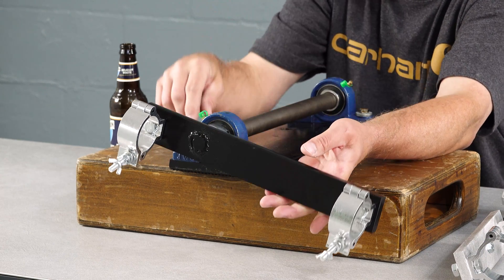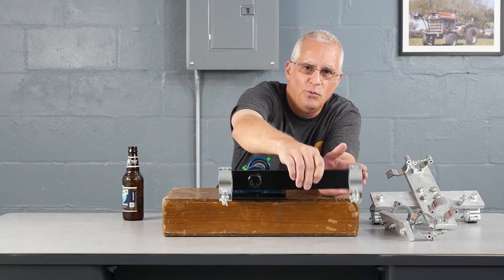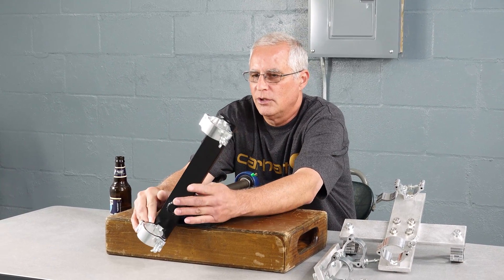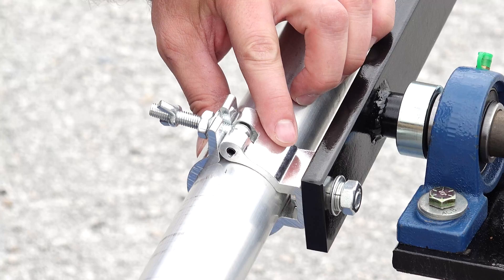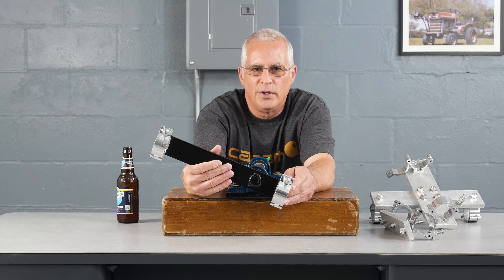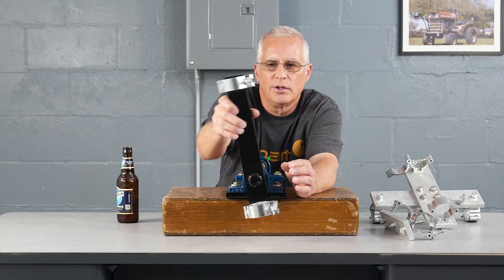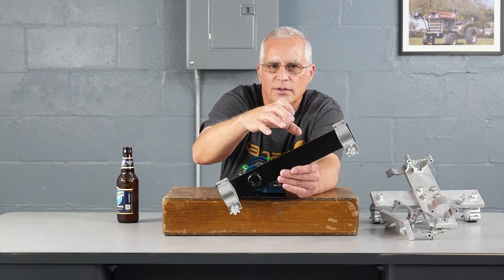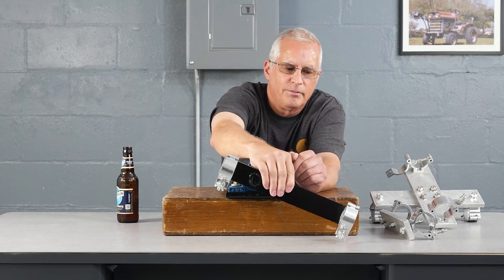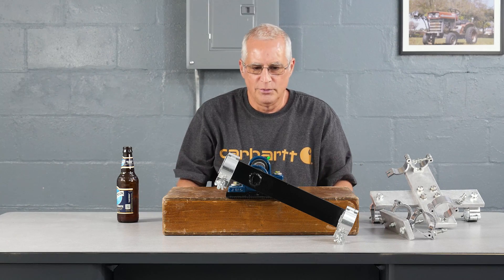So this is all hand drilled. This piece rotates, and we use one and a half inch speed rail. You could do it with one and a quarter inch, one inch, or two inch speed rail — whatever you want. We thought it could manage a good 10-foot span. What we found out is there's a little bit of flex in these clamps and they tend to wobble a little bit. It's fine if you were going maybe five feet out and doing a 10-foot arc, but if you're trying to do a 20-foot arc it starts to twist a little bit. Depending on how far out you're going, if you're going 10 feet out with your camera over the object, it gets a little floppy. You could put a Ronin on it and that would solve the problem, but we wanted to make it steady.